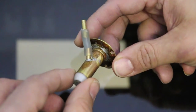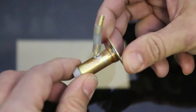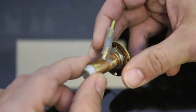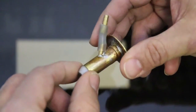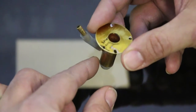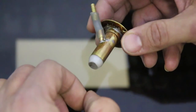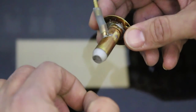This is our next attempt at creating a better cutting nozzle for our EXT laser. It's constructed mainly out of sheet brass. We've adapted the air intake fitting with a little bit of neoprene tubing and added some ultra-high molecular weight plastic for a nozzle tip. This gives us the double advantage that when we mount this onto the lens assembly we're totally sealing in where the lens actually sits, so we don't have to worry about debris getting onto the bottom lens, which has been an issue with cut quality — that's where most of the problems come from.